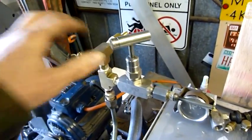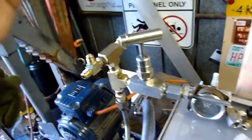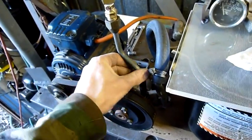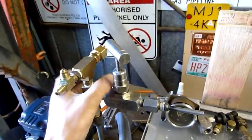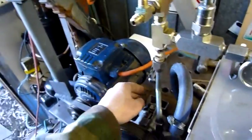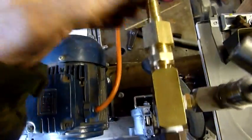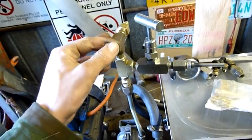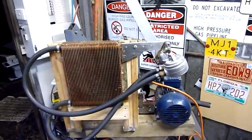Revision 2 - after I forgot to put the second T on there - now I have an outlet, a service port, a high-pressure switch, and a manual bypass valve. Just got to work out a position for it. As you can see, that can swing inside its fitting. I'm thinking I'll tack-weld something off the side here and have it come up with a polyethylene spacer - a little block of polyethylene, or some 25 by 25 square tube - so I can make an upright and clamp it fairly tight. I just want to stop it from being able to wiggle around.